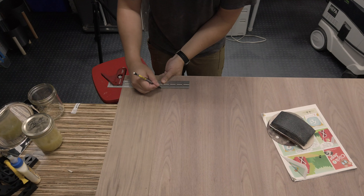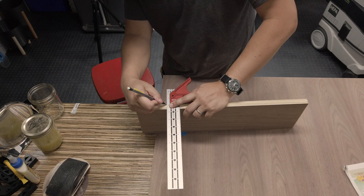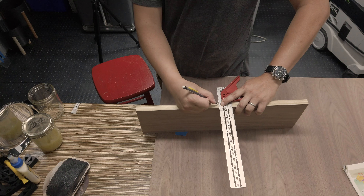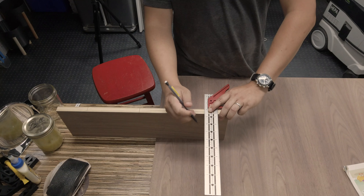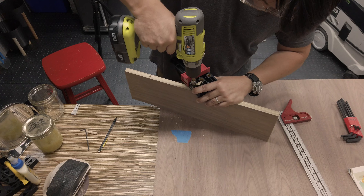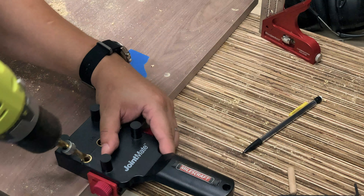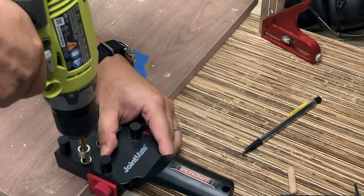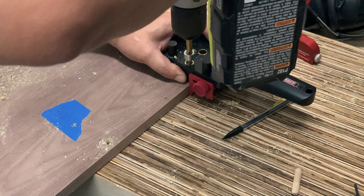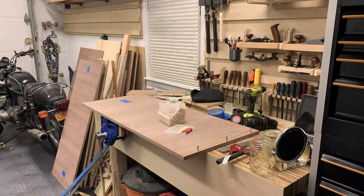Here I'm starting to put in my dowels to join the boards. I have the sides lined up next to each other and marking three spots where the dowels will go into the sides and on the top and bottoms of the boards. I transferred the marks to the edge and used my dowel jig from Miles Craft to drill the holes. Then I transferred the same holes and used the etched guides for the inside panels, going through all the top and bottom pieces.